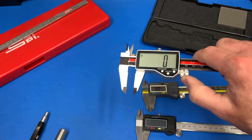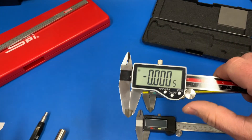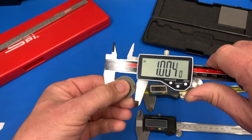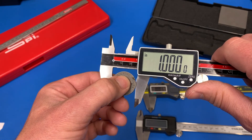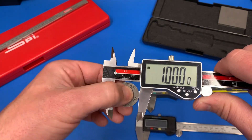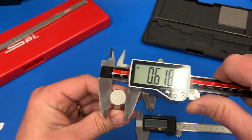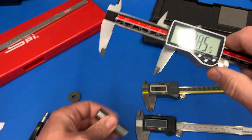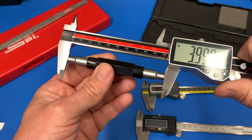How about these new ones? Same thing — I want to get into thousandths. Let's clean them. Zeroed. Let's do the 1 inch — it's kind of flipping back and forth, but if I stop moving we're right at one. The display on this one does seem a little bit slower, but we are at one. I see it occasionally flipping to half a thou under, but I'm calling that right on. Let's do the 619 — that is half a thou under. And the two is dead on. Four inch — half a thou under.